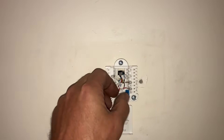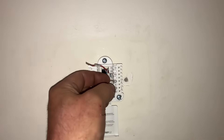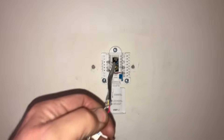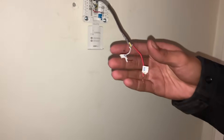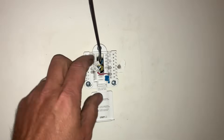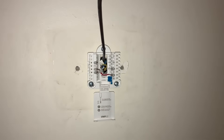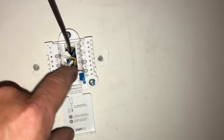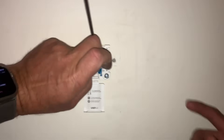What's this wire called RH? Just hanging out there. RH is just hanging out. W is plugged into the W terminal. And I'm going to guess this is a two-wire — yeah, two wires. Look at that. Do you know where that wire is going, Derek? To the heating system, whatever they have. And the other looks like we have a common, we have a G for fan. What does Y do? And then there's R. Let's just take out this R wire.